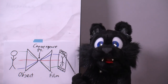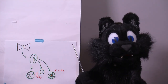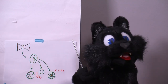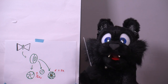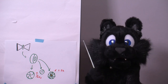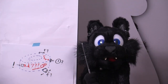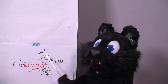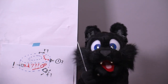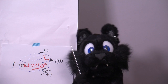Making the glass parts is a complicated science — or dark magic. Right in the center point we have the shutter. Those also came in a few standard models: Copal 1, 2, or 3 seemed to be popular models. The shutter is arranged in a ring and contains all the mechanical parts of the lens: the aperture, timing, and the actual shutter blades. All the features of the shutter mechanic have to fit into a very small donut-shaped form factor and are extremely delicate. Note that the shutter can open and close within 1/400th of a second. So, let's have a peek!